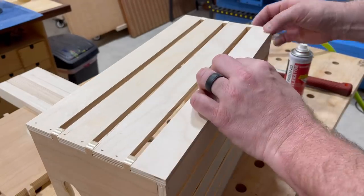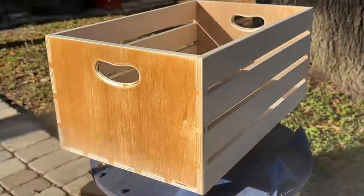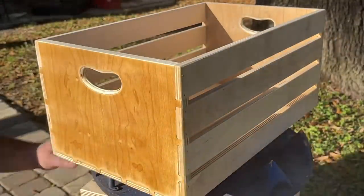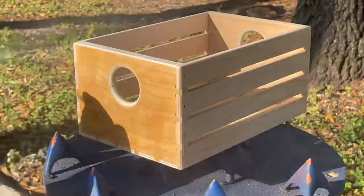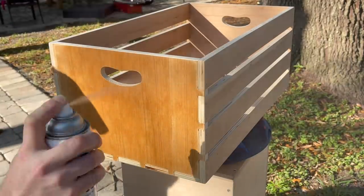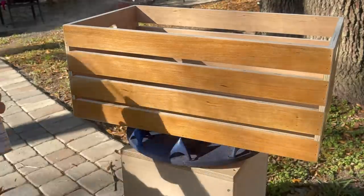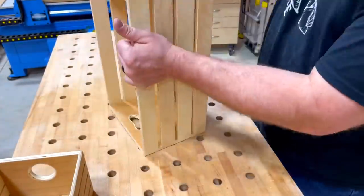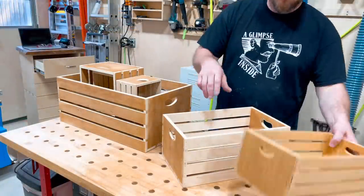With these built and assembled with a light sanding, I take them out and apply more finish. Honestly, spray lacquer was my finishing choice — nothing wrong with the oil, it looked great, but lacquer was just a little easier. These coats dry in about five minutes so you can do it very quickly. Once dry, I use a medium-density Scotch-Brite pad to knock off the fuzzies — the spray lacquer leaves a slight film and roughness, and the pad makes it buttery smooth. If you're going to make something, make it nice.